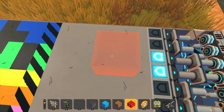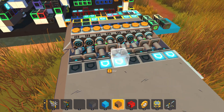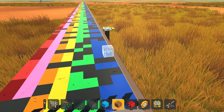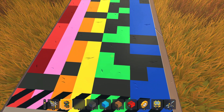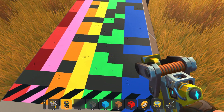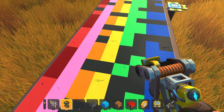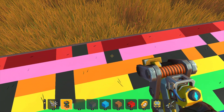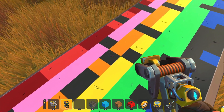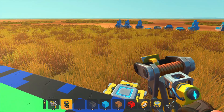Buried in this gray section there is a binary counter. Whereas the rest of the system runs with 4-bit binary, this specifically runs with 8-bit binary. However because of how it's stacked, I would still argue this entire system is 8-bit binary, even though the memory circuits are only 4-bits for their particular purposes. So as we go down this we can read a bunch of different commands — draw a vertical line, reset to the bottom of the bed at these XY coordinates, draw a line of this length, and this keeps going until you get to the next layer, which moves the print head up a layer. Then it draws a horizontal line, and eventually you see draw square commands with coordinates and length, continuing to print the Banshee.